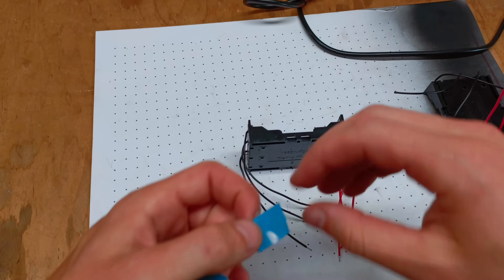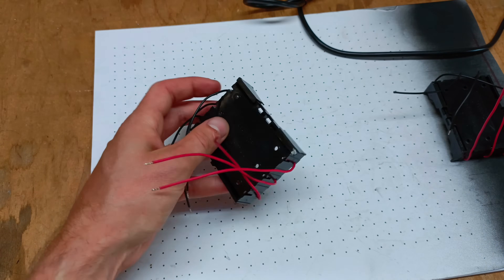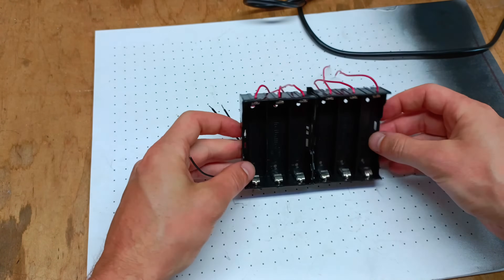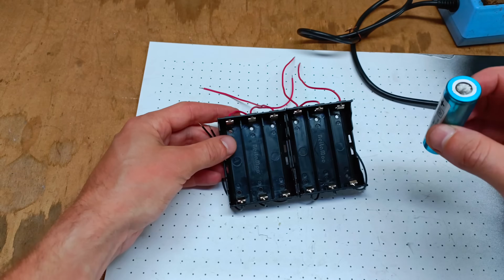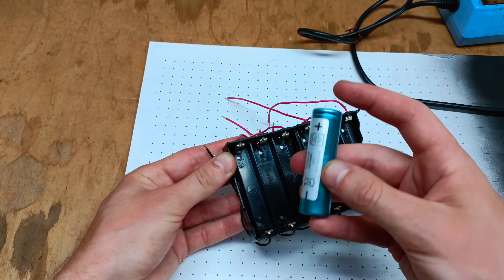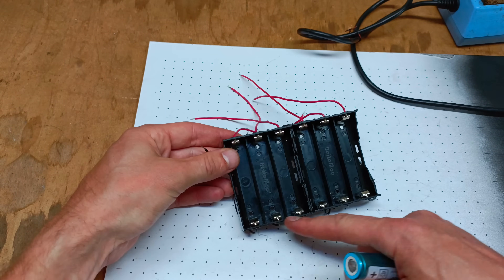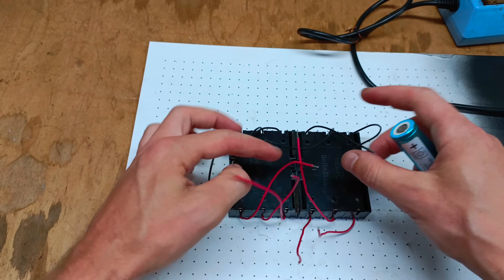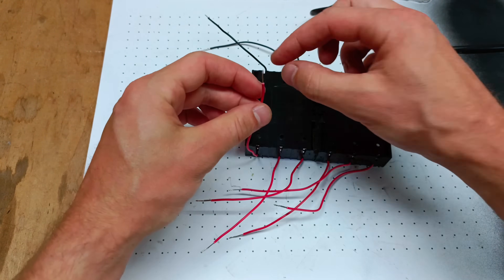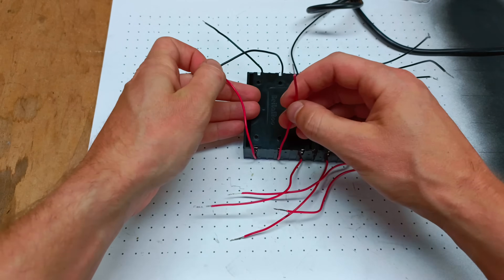Now it's time to assemble perhaps the most important component of any power bank: the lithium-ion cells, the charging circuit and the monitoring system. As I mentioned at the beginning of the episode, the Powerbox will have the capability to swap out lithium-ion cells. For this purpose I am using two battery holders, each accommodating three cells. I attach the holders together using double-sided tape. Next I need to connect the wires of each holder so that the output voltage of the entire set of six cells is approximately 12V. The cells will form a 3S2P configuration, which means three cells connected in series and two in parallel. I connect the holders so that the lower pins form a negative bus and the upper pins with the red wires form a positive bus. This configuration will make it easier to place cells and reduce the risk of mistakes when placing them.